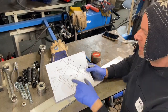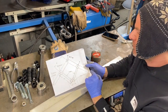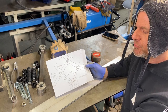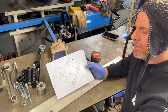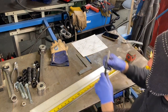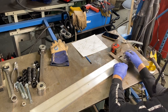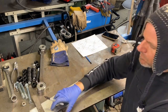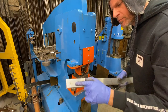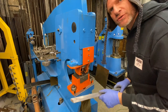Now we're going to mark up these two bars, which are our half inch by two inch aluminum bar. They are thirty-two inches long from outside. We're going to mark a center point and two points on either side — that will be an inch and an eighth from the outside. So let's punch some holes on our iron worker. We're going to punch some five eighths holes and one one inch hole, and that one inch hole is going to hold our plasma cutter.